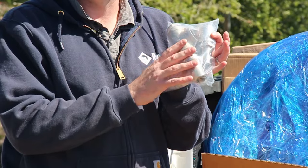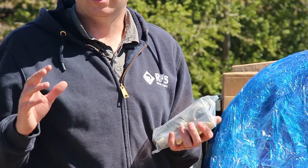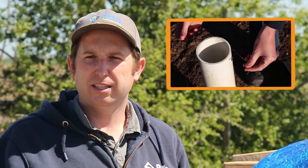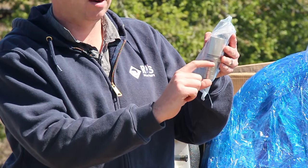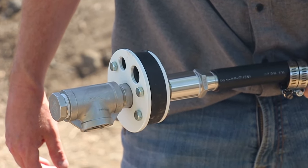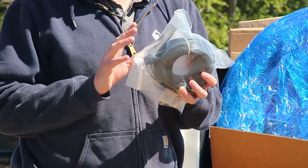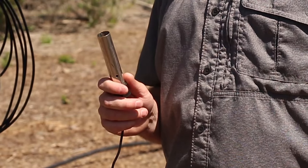We also have our through fittings for our well seal. The well seal comes in multiple sizes — you'll need to let us know whether you need a four-inch, five-inch, six-inch, or whatever matches your casing. These are stainless steel fittings with great corrosion resistance. When we put this through the well seal, the pump is going to hang off the bottom and we'll have a one-inch outlet to hook up whatever plumbing you need. If you order a 200-foot or 300-foot turnkey kit, you'll get a different low water sensor with matching wire length, making it super easy so you don't have to splice any of the wire.